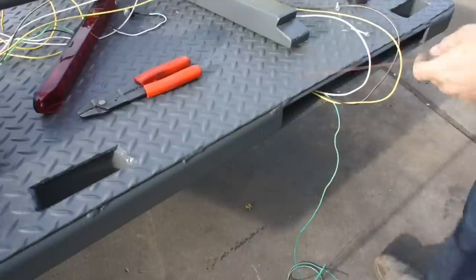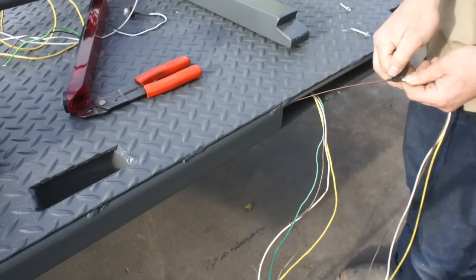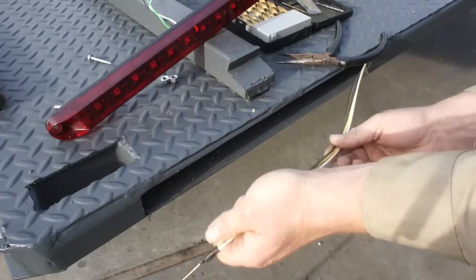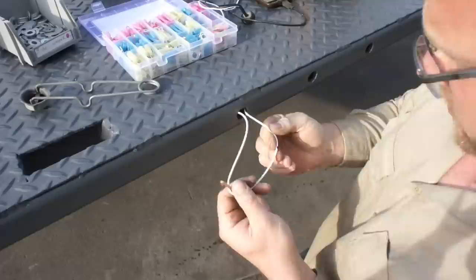All right, we've got our piece of chase rod here, a couple of pieces of TIG wire. If I was pulling through a really tight area, I would stagger these wires, but this is basically 1.5 by 1.5 on the inside. I think what's holding us up from being able to just push the wires through is those little slugs that I cut out for the lights. Easy as pie. So we're just gonna fish that out. All right, there's our first one right there. We need the brown.